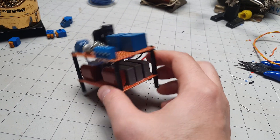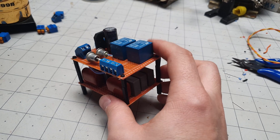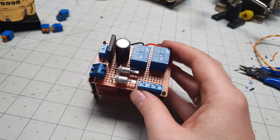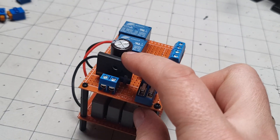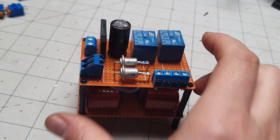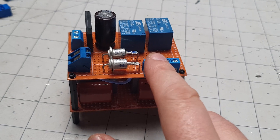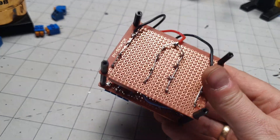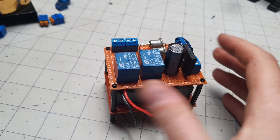Here's what we've got so far — this is our circuit. I put all the main capacitors on the bottom board and everything else on the top: two relays, the big filter cap, the bridge rectifier, and the two diodes. And these are our outputs to our phones. These are our two AC lines coming in. I'll probably put some insulation over the bottom here — nice and compact.